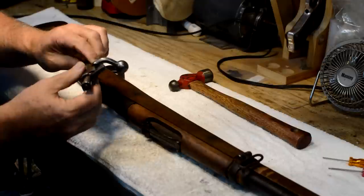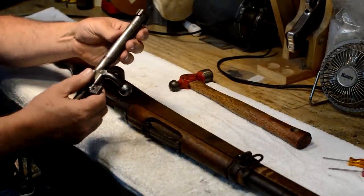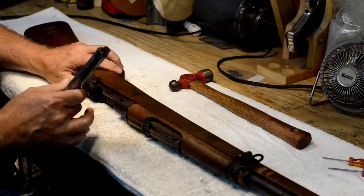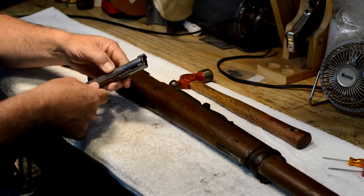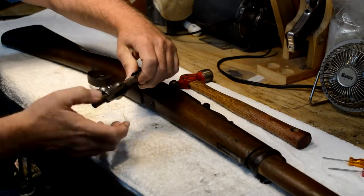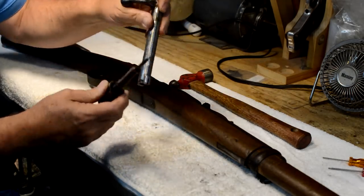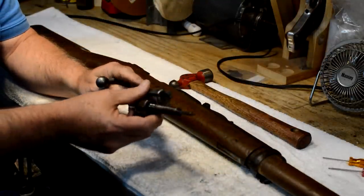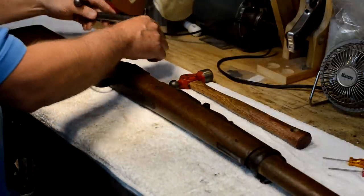Lubricant, the equivalent of our cosmoline, but this is a little simpler than the Model 98 bolt. This is a Model 93 pattern gun, although it is a 1916 refurb to the 1916 pattern. It's very simple, and once you got it at 12 o'clock, you can unscrew the fire control, and now you're separated into your fire control unit and your bolt body with the attached extractor. These can then be set aside and then cleaned later.